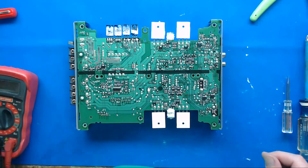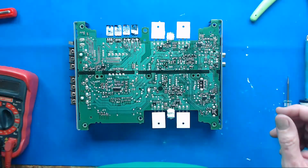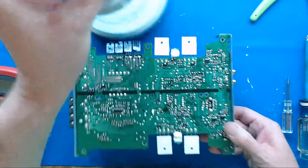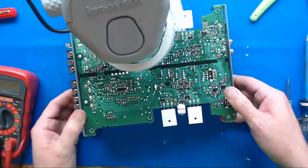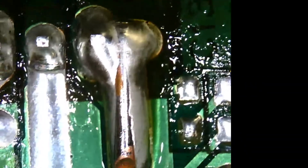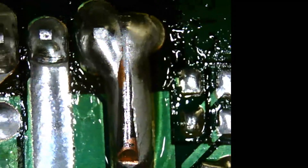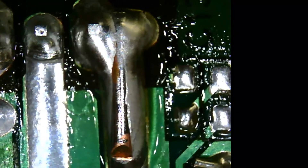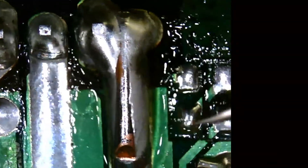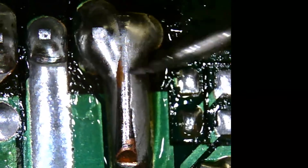Okay, so did some soldering. Bring my magnifier back in, see if we can show you some of this. Remember where that one on the diode was, and I said I was going to add a little piece of copper — we have done just that. Stuck a little piece of copper wire all the way across, bedded it in some there. That looks good.